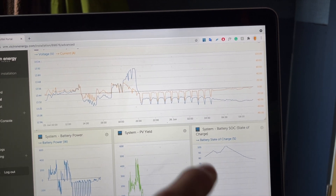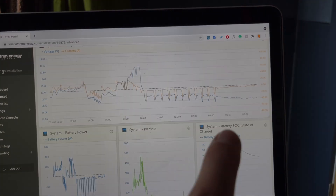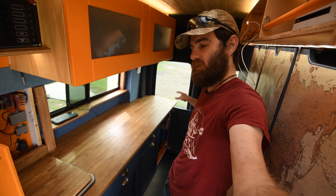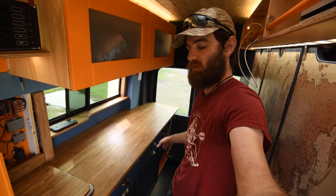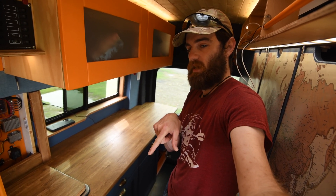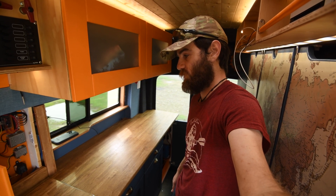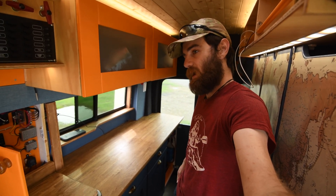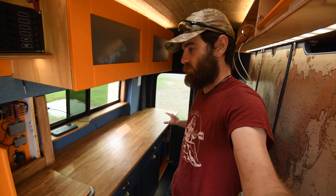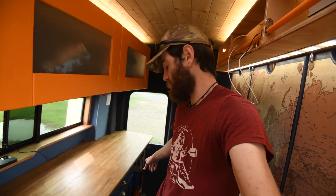I realize in some ways this is effectively an analog logic system — is the battery voltage between the trigger thresholds? If yes, and is the water temperature below the setpoint? If yes, turn it on. Someone handy with an Arduino or microcontroller could make this more sophisticated digitally rather than doing it mechanically, but all the components were cheap. Even if you don't have a Victron-style MPPT, you can get dump load voltage relays — similar to the temperature relays but checking system voltage instead — and add those inline to your existing system.